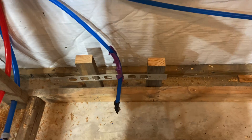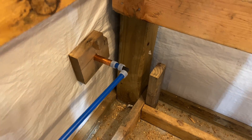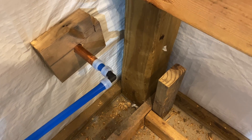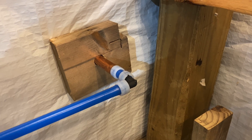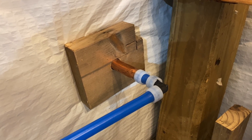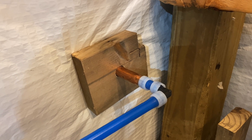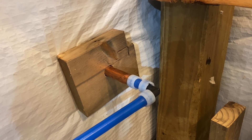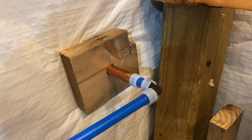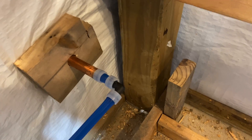Moving into the bathroom, you can see there's the stub-out for the toilet — just a cold line, similar fashion. And over here, the outdoor hose spigot. I had to use fittings here because my plywood or drywall is going to sit right on the outside of this 2x4 and I couldn't get a bend in there. That's a 4-inch frost-free hose bib — the shortest I could find that was PEX-compatible. That one's a Woodford. I've been very happy with the build quality from what I can see. So I've got spigots front and back.